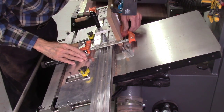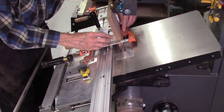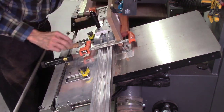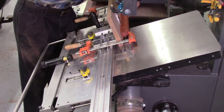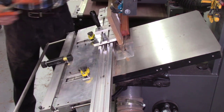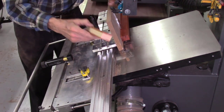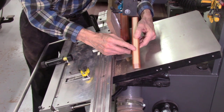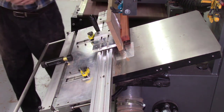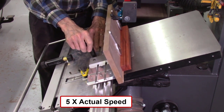I'm cutting my solid board first. I set my distance by running the blade through, then rotating the board 180 degrees — it lined right up. I put my board on, put my clamps on, got my offset clamps tight, and I'm ready to cut. I'm cutting such that the wide face will be the outside surfaces. All the bandsaw slicing in this video is shown at five times the actual cutting speed for viewing purposes, but the slower you cut, the smoother the cuts.